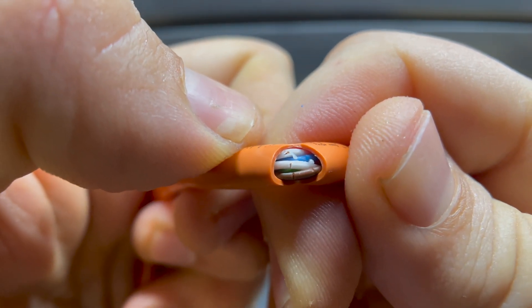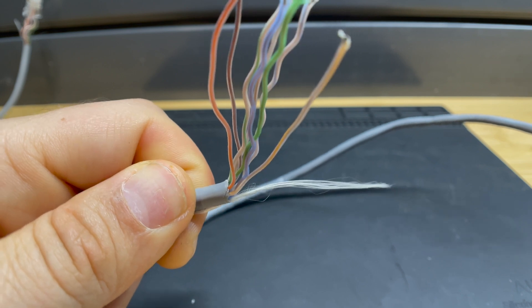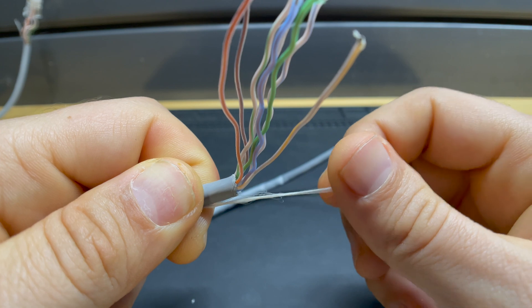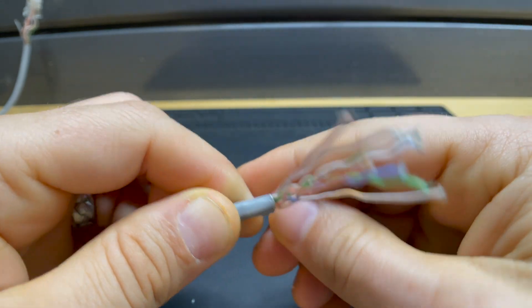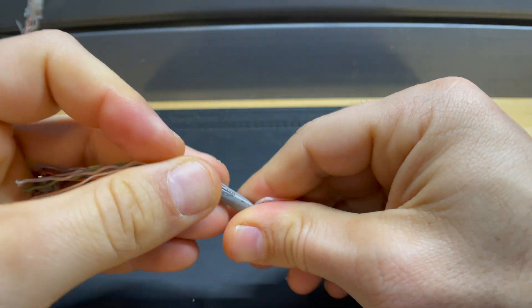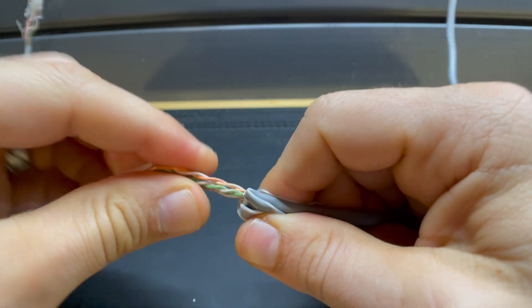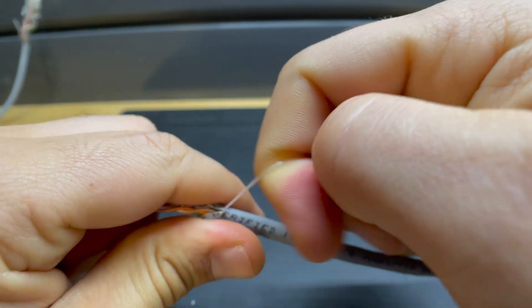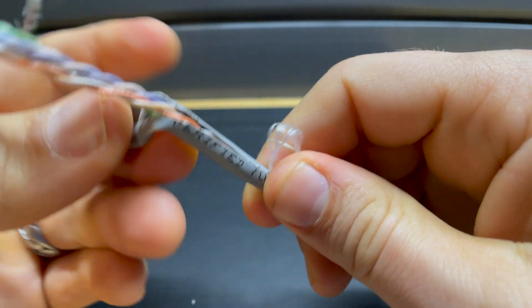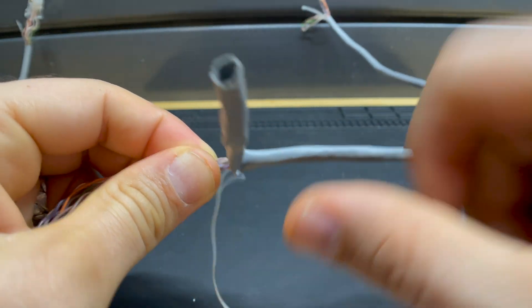Here's something to watch out for when using wire strippers — you can see I'm actually hitting that inner insulation. One of the best ways to avoid nicking the inner wires is by using cable with a rip cord. Here you can see the rip cord right here. As you pull on it, you're able to cut through the outer jacket without worrying about clipping any of those wires. Just by pulling on this string, you can cut right through that outer jacket. Then you'd want to trim that away.